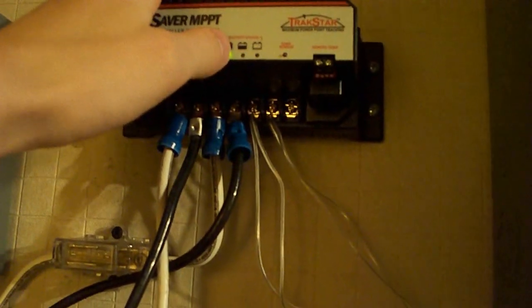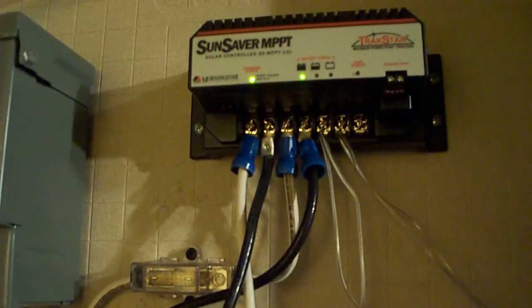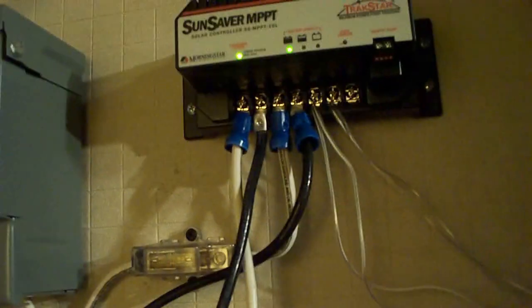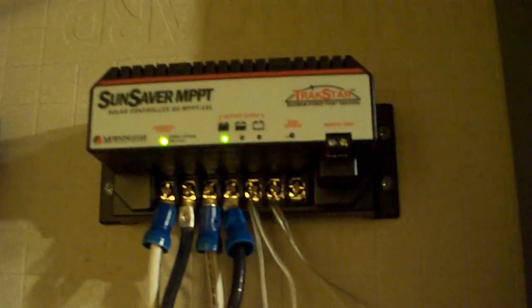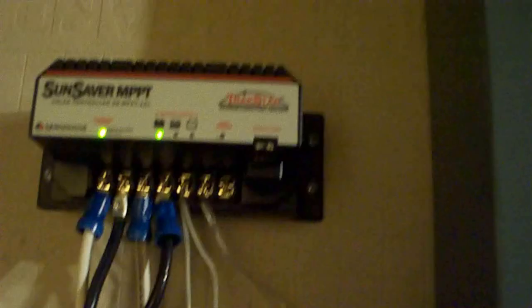The meters were $13 from Fry's Electronics. The breaker was $20 at Home Depot. The MPPT charge controller was $230 — that was the most expensive part of the project, because taking all that voltage and turning it into amperage requires good switching transformers that have to handle a lot of current. The fuse holders I got at Walmart — pretty cheap, and since everything's 12 volts, it works out perfectly.